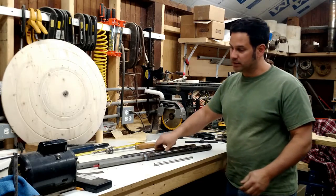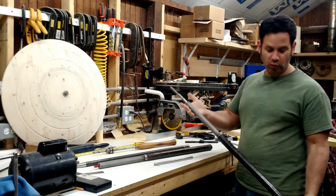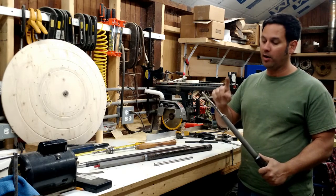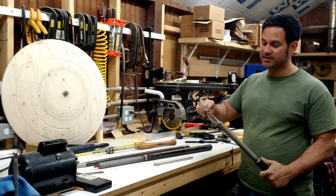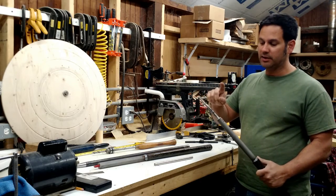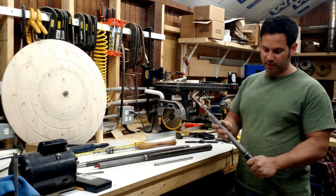The next tool is my end grain bowl tool — this is my end grain bowl gouge. If you're not familiar with end grain bowl work, you'll find that a spindle gouge works extremely well on end grain bowls. This is not a bowl gouge, it's a spindle gouge. And of course, never use a spindle gouge on a face grain project, but for end grain it works phenomenally — to hollow out and shape and cut them on a bowl.